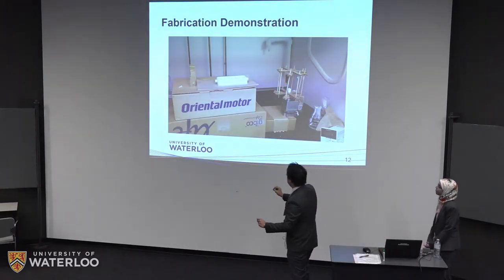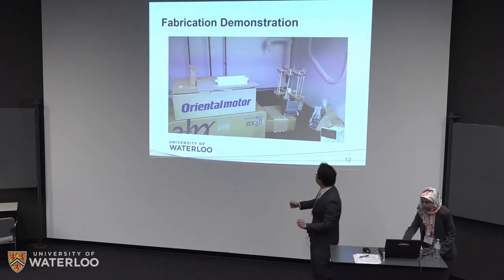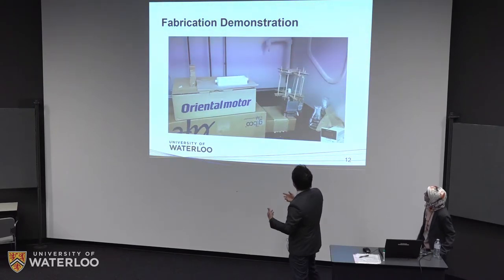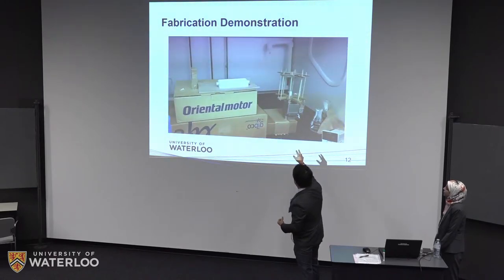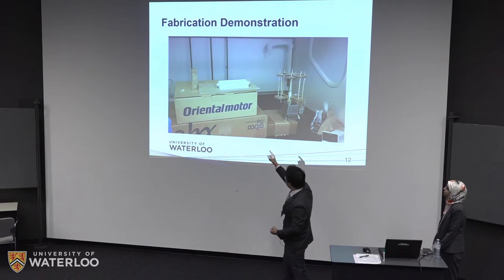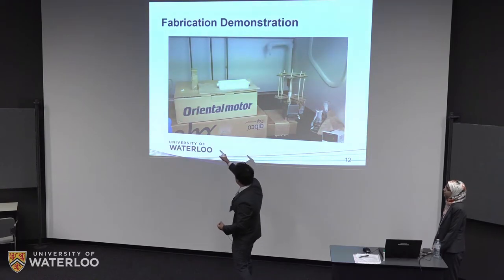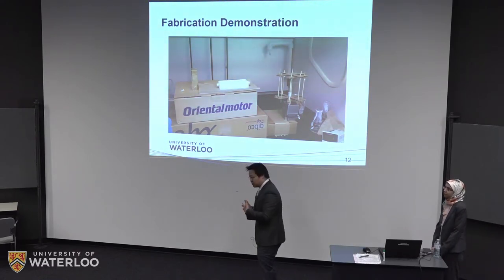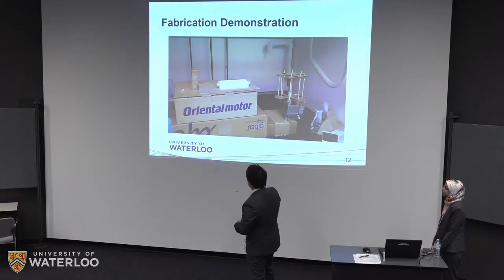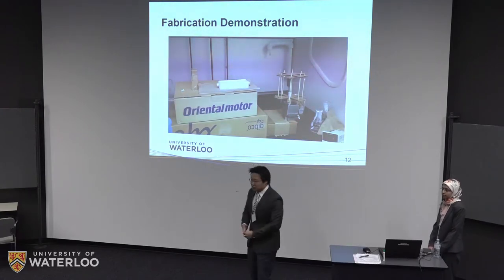We have a video showing how we make our fiber. We have a motor with a homemade drum mounted onto it, pulling the fiber from a reservoir filled with polymer solution. The thread is fed from the left side and pulled from the right side, coating the fiber in a uniform fashion. By controlling the speed of the motor and the concentration of the polymer solution, we are able to produce different samples, which we optimize in the results section.